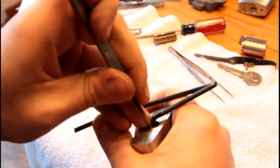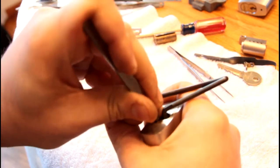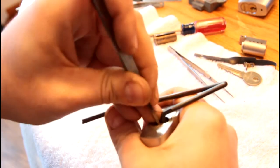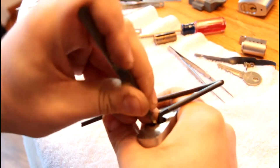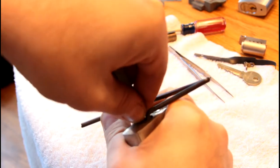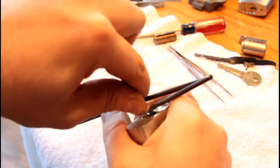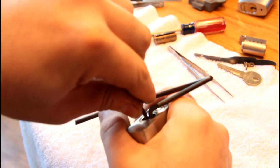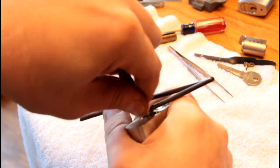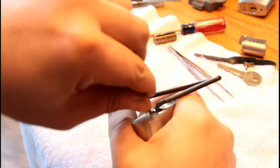I set it down on the ceramic plate — that's why I was using the stove in the other video, because it spreads the heat better. I set the plate across a basin of cool water or brine, and just as the whole piece is at the right temperature, I knock it off the edge into the water. You don't have quite as much control, but it avoids differential heating and parts not getting fully hardened. Leave it until it stops sizzling, then pop it out.